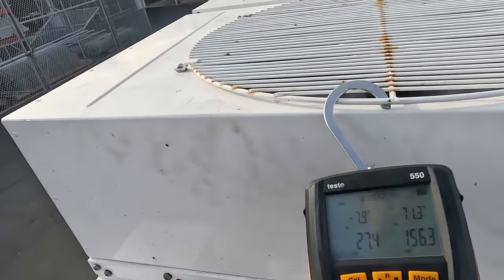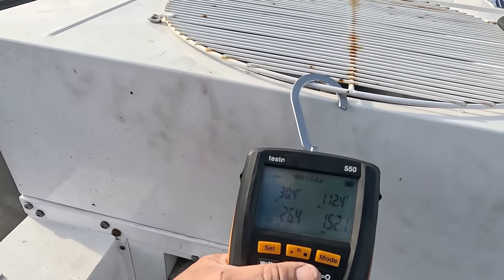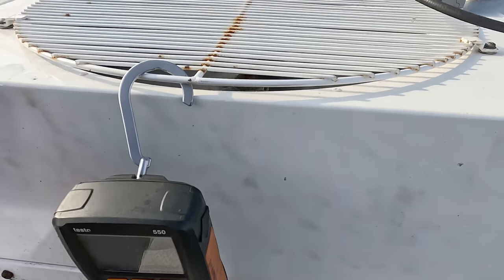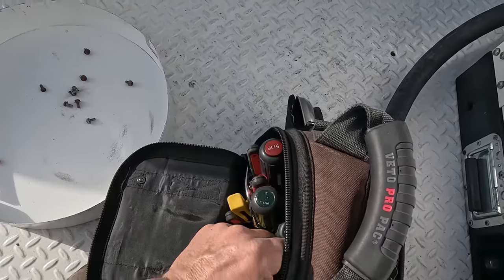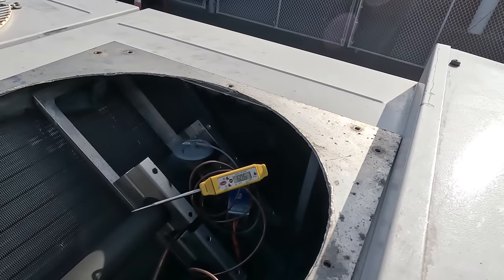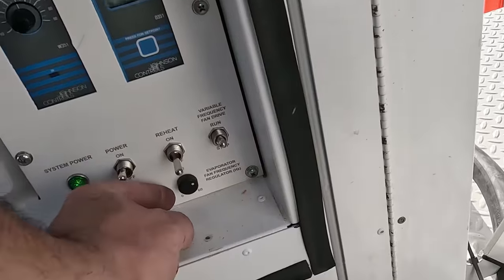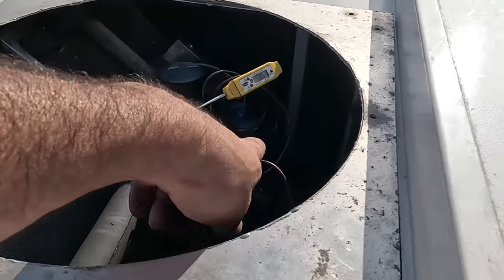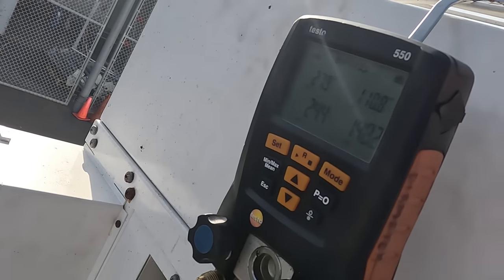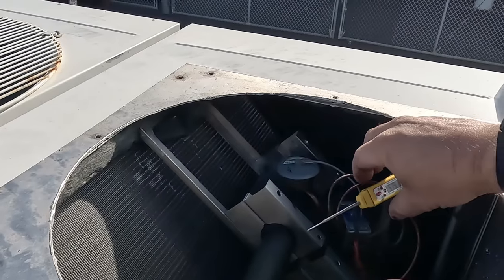We know it's about 75 degrees out here. So we're running 112 degrees out here and 30 degree evaporator temperature — very little load on it. 74 degrees — running about 35 to 40 degrees over the ambient. We've got air filters on the condenser. Everything looks good there. Sight glasses look fine. Now we're running full speed here — we can slow that blower down if we want. If you want to really dehumidify, slow that down. Suction pressure is down to 28 degrees and 110 on the head. You lower the suction, you lower the head a little bit. That made a hell of a difference.